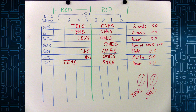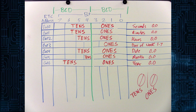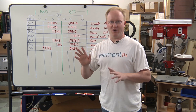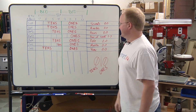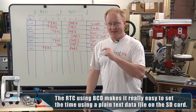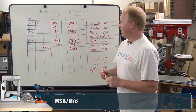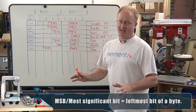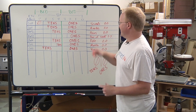BCD is also convenient when reading a value off the SD card to set the time. You make a file called set_time and the date is written out — say the date is December, so one-two-twelve. You read the file off the SD card, get '1', stick it there, get '2', stick it there, and you have the right date in your RTC. It's always important to check your data sheets — there was a gotcha with this chip. When you first set it up, the MSB — most significant bit — of the seconds counter acts as an oscillation starter. You have to put a zero there, otherwise it will not start counting the time; if there's a one there, it pauses. So when you write the seconds, just make sure that bit is a zero.